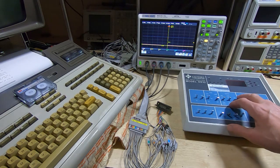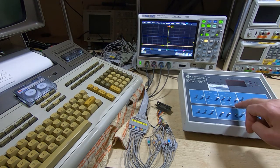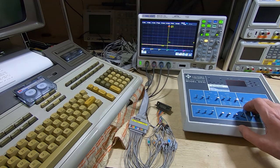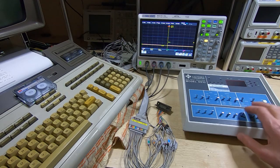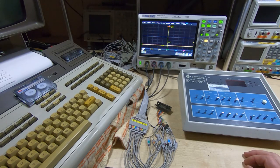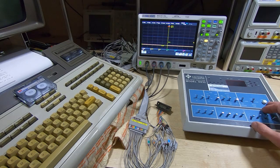These are kind of old but can be very useful and fairly interesting to work on as well. You'll probably find if you buy one of these it won't work. They have sandwich assembly PCBs inside with weird connectors between the two that fall to pieces. Chances are if you get one it will rattle and there'll be most of those little connector bits floating around inside. So if you do get one, don't try and turn it on, because you will probably do quite a lot of damage - they do tend to short together as they move around.